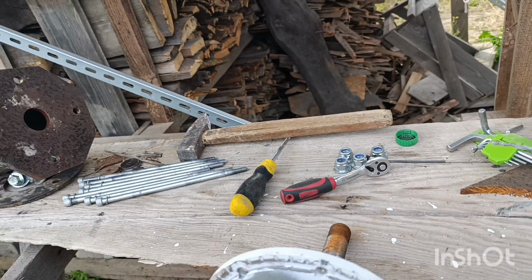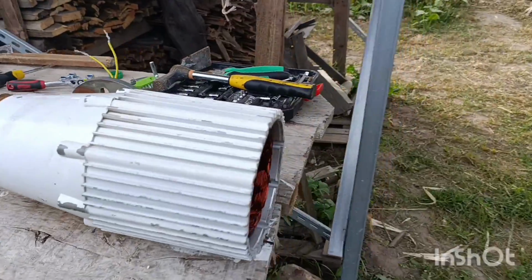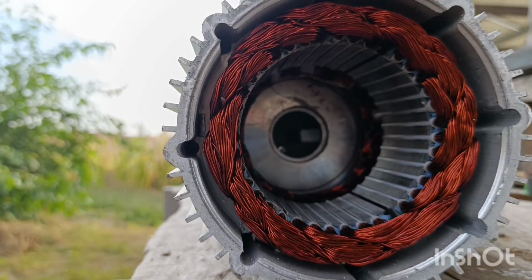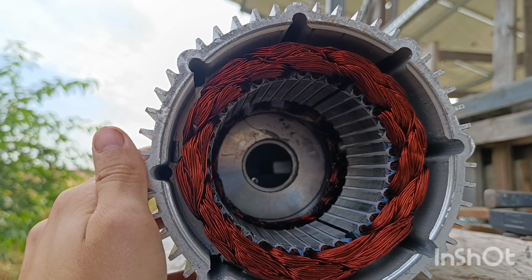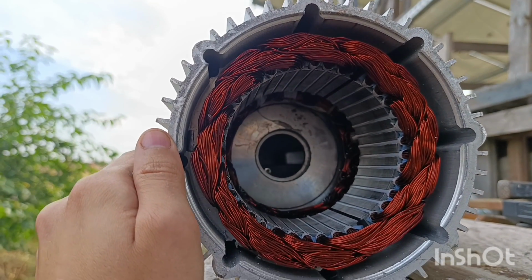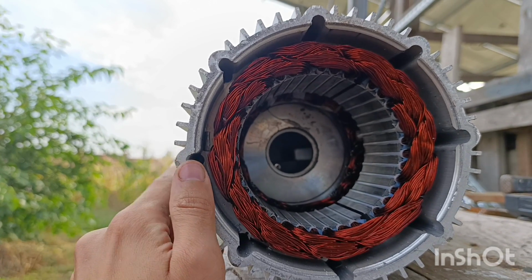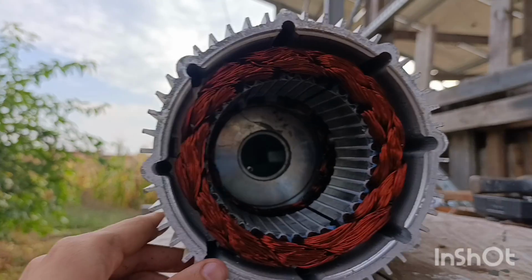That's because eventually I will have a better controller than I currently have, because the current one is total shit. I will be throwing it away because it's not good for the FT-1000 and for this one as well. The new one can calculate the revolutions, but to do this accurately, it needs the exact number of poles, because once you have the polarity changes, you can easily calculate the exact revolutions of the generator itself.